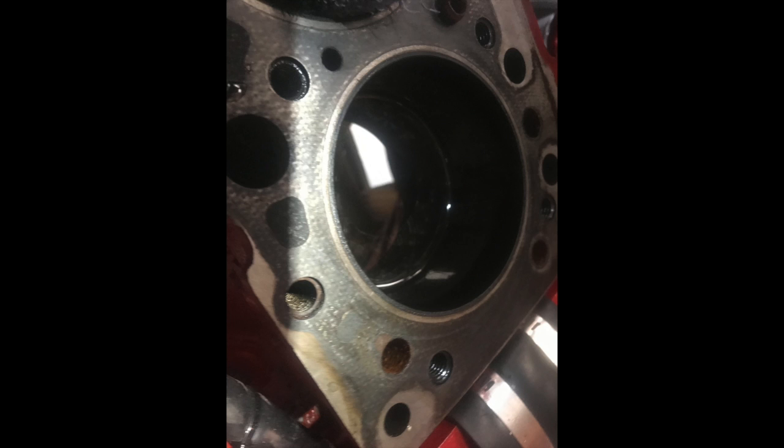This is the rear port that is soaking. I soaked it in total 3.5 weeks before being able to get the cylinder moving. And you'll see a block of wood, which I used to drive it down. So not really the best way to do things, but it wasn't going to move at all.